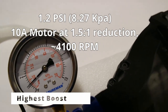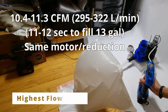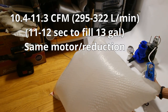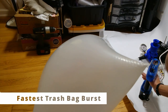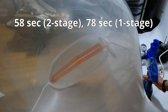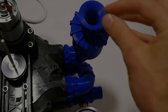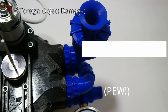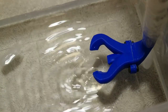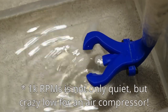The two-stage build of this compressor performs beyond my wildest expectations. It gets about twice the pressure head for any given RPM compared to the single-stage version, although it also needs at least double the power input. It could probably do a lot more if I put more motor power on it. Most importantly, it can supply way more than enough for my printer part cooling needs at about 1,000 RPM, which is very quiet.